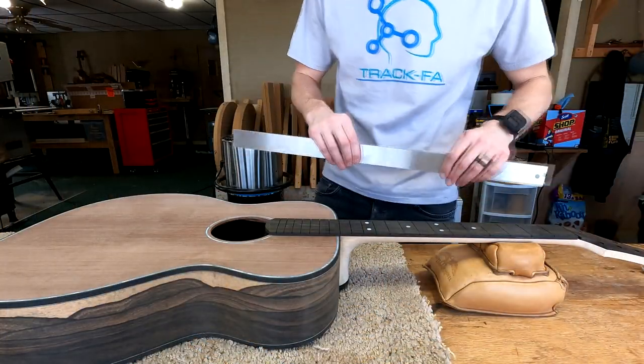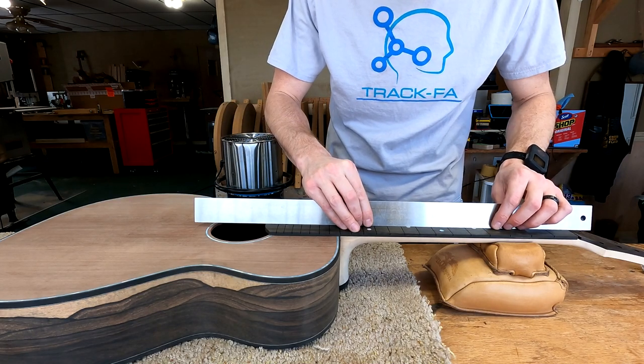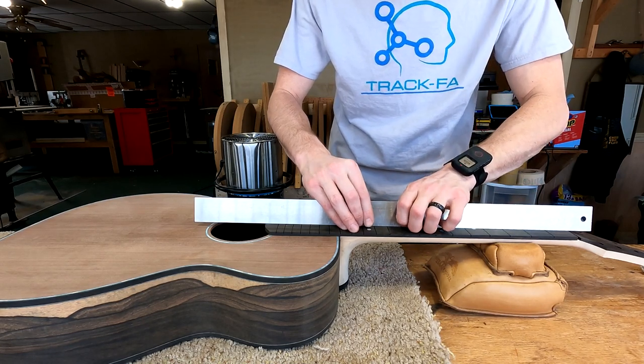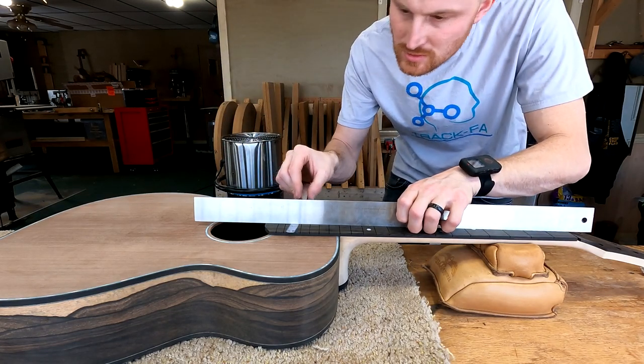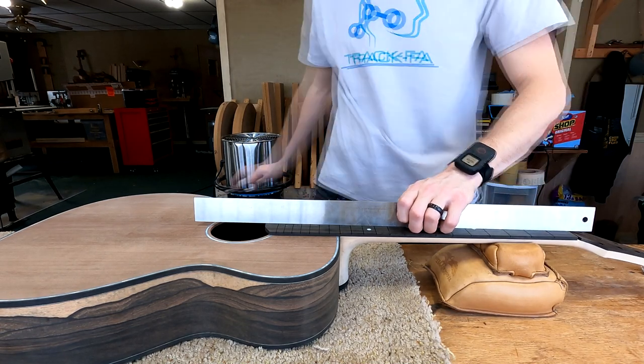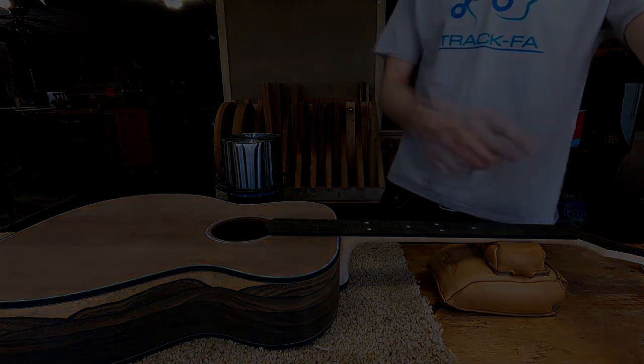This is what I mean by the fall-away. The fretboard is dead flat except for the fretboard tongue, where there is a very, very slight gap — I can fit a thousandths-of-an-inch feeler gauge underneath. Relief in the neck is desirable, and along most of the neck's length it's achieved by string tension pulling the neck into a small amount of relief. However, the fretboard tongue is not part of that dynamic system — it is fastened securely to the sound box and cannot move. So we manually introduce that tiny amount of fall-away by sanding.